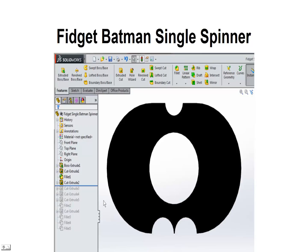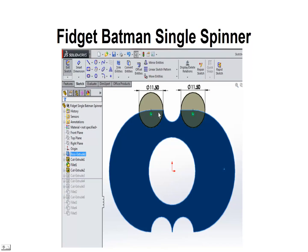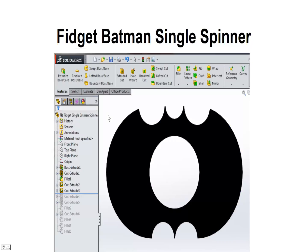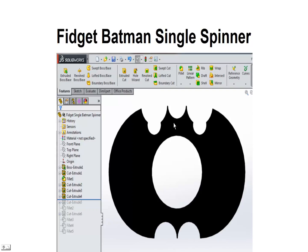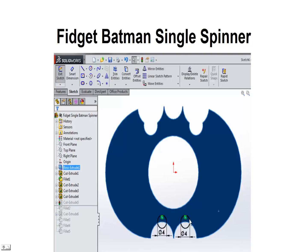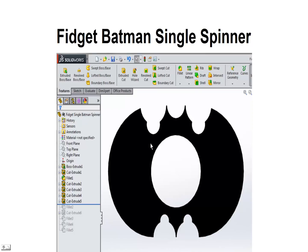We still need to make some more cuts to continue on with our Batman shape. We're going to make a couple of cuts up here — 11.5 millimeters — to help start forming the head. Next we're going to do another little cut, only 6mm, coming down from the center of that last arc, cutting that out to get the head shaped a little bit better. Then continuing on we're going to make some more cuts down at the bottom to help shape the tail — 4mm each. Now we've got the tail started and the head started.